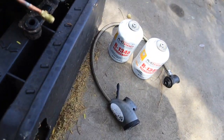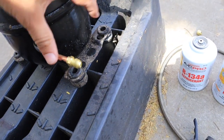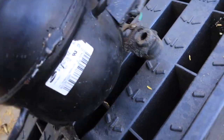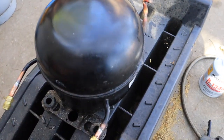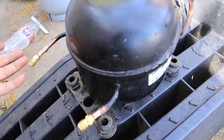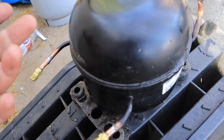This is the one I was telling you guys about. I've seen that you can make these into air compressors if you have a tank — you've got your low and high, it vacuums and throws out air. This is an AC compressor from a refrigerator, not a car AC. I used this as a vacuum pump. It doesn't work like those vacuum pumps from Harbor Freight, but it's smaller and it does the work — I was able to vacuum everything out.